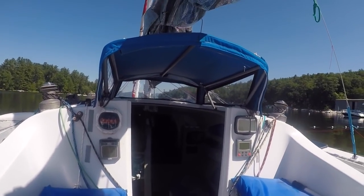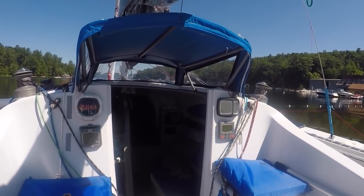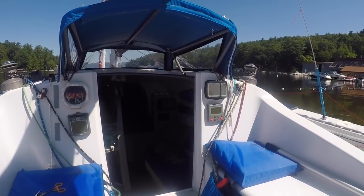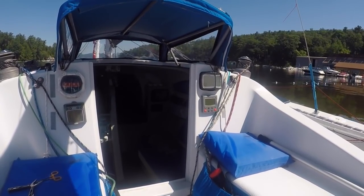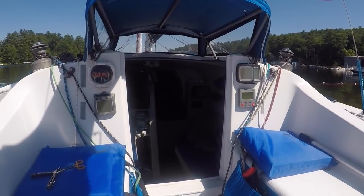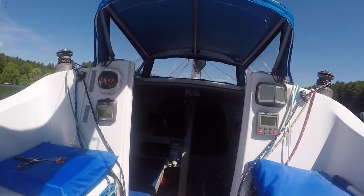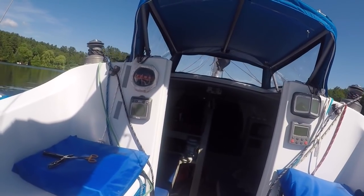The interior. My design goal here was just minimal but functional. Ed did not finish the interior of the boat. He took a bunch of J-boat sailors sailing on Lake Ontario and they told him, 'Don't you dare touch this boat — it's just a lightweight razor.' So the interior was completely unfinished, just black carbon, sharp edges, things like that. I couldn't really have that with my 11-year-old daughter and a wife who every once in a while I can actually get on board this boat. So I sanded everything down, no sharp edges, and then painted with Interlux Brightside. I just like the Brightside — it's resistant to everything, it's hard, and it just lasts.